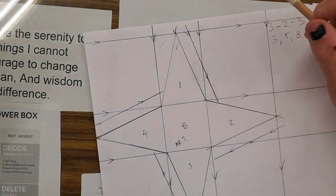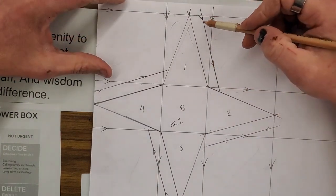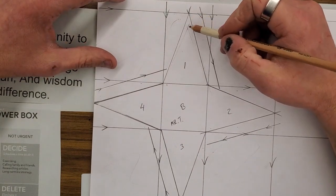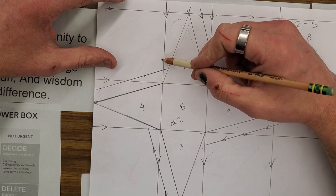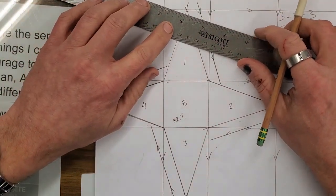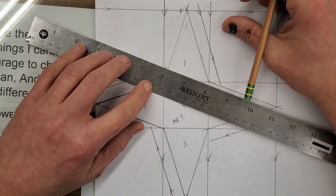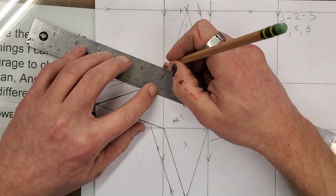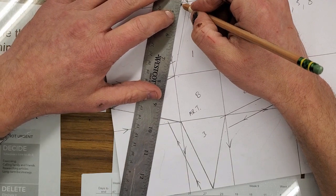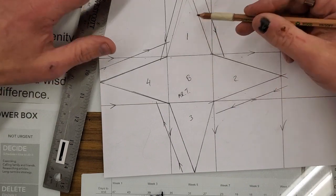So we're going to mark hems. The hems are pretty much just like the tab, but skinnier. So on this side, we're going to measure over 1/4 of an inch and draw a line. Well, let's do that. So I'm going to go right there, 1/4, mark my first arrow. Down here, mark my second arrow. And scratch my line.